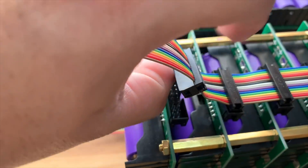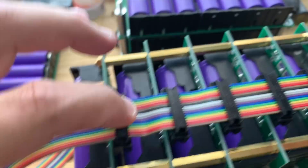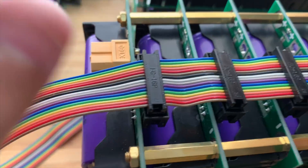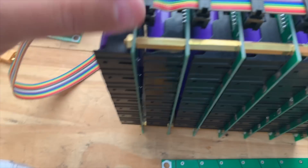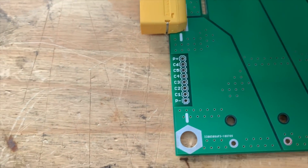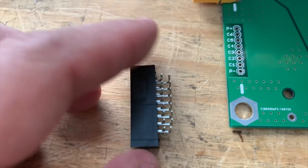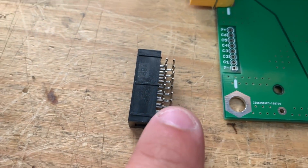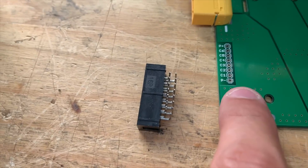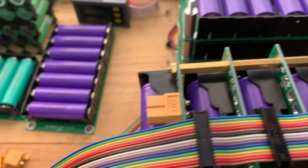I just use regular pliers, applying pressure evenly a couple of times. I'll have to test them but we'll do that on the next video. For now I want to show you how you will install them on your old PCBs, because this board was not designed for that — it's got a single line of pins where it really requires a double line of pins. The design we're going with is to have two of these pins be the same trace.